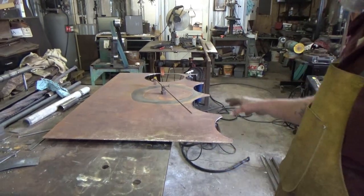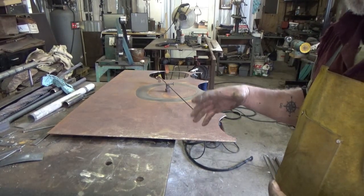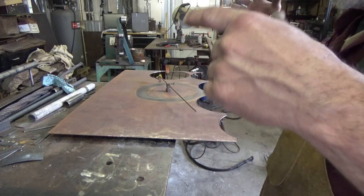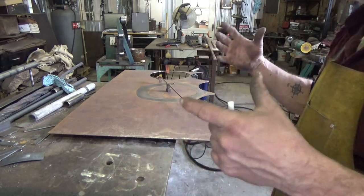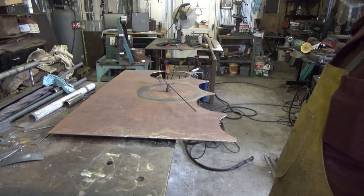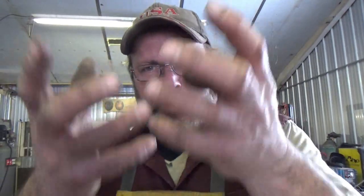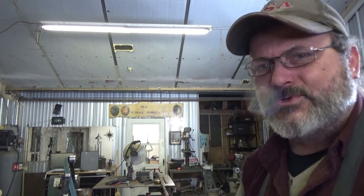So anyway, we're going to start off, we're going to cut off about an 18-inch, a little bigger than an 18-inch disc, because I do want a decent-sized pan. Like I said, when you do scrambled eggs for a family anyway, you end up with a pretty large mixture that you reduce down into the scrambled eggs. So we'll cut that out with a plasma cutter, and then I'm going to use the older technique, the bowl technique, where you drop the bottom. You actually thin the bottom, that creates a bowl, and then you flatten this inner part of the bowl.